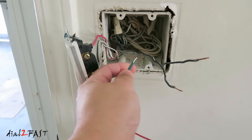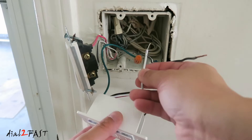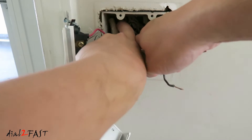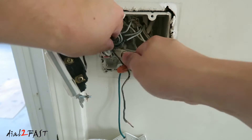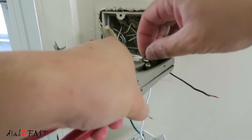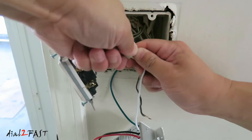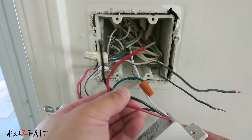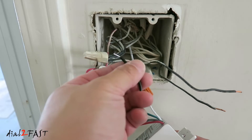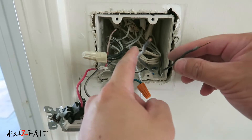Let's first connect the ground wire. Next we need to connect the neutral wire. The neutral wire is a white wire, and I need to connect this to the white wire at the back right here. I'm going to strip some of the insulator so I can wrap it around the neutral wire. The remaining wires on the dimmer switch are a black wire and a red wire. The black wire will go to the live wire — this is the voltage coming in — and then the red wire will go out to the light. This is the voltage going out.